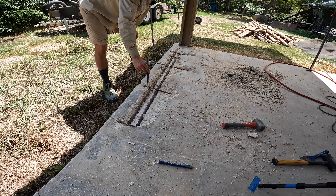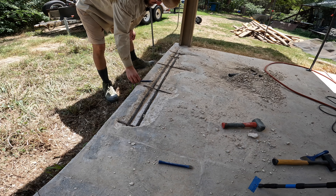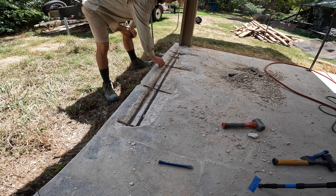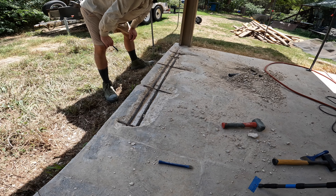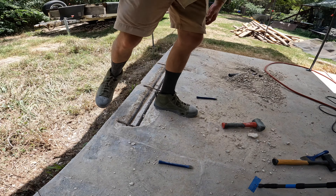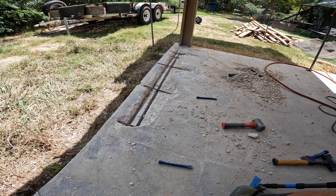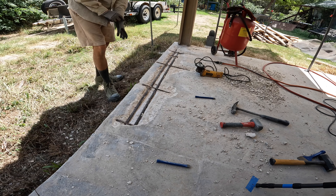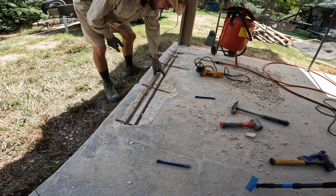You're also going to see me trim these rebar back — this is literally sticking up above the level of where the concrete goes, which is outrageous. So in the next few scenes I'm going to de-rust with my sand blaster, trim the rebars back, and then paint it up to get it waterproof. I figured I'd get the big chunks of concrete removed first so the sand is actually able to hit the metal rather than being blocked by cement adhering to it.